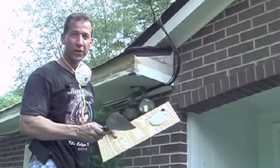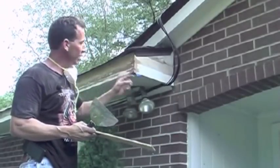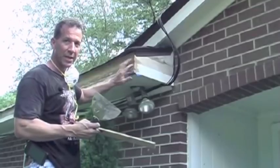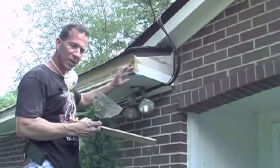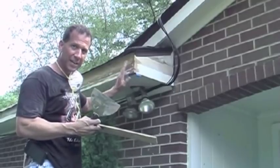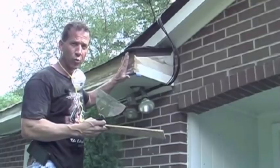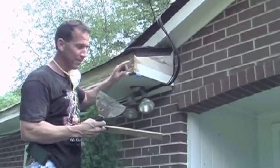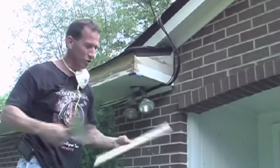The best wood filler is body filler. I use Bondo for these corners. This corner is not rotted — it just swelled up some. You know how those corners will do when water gets in between there. If you fill this up with Bondo and sand it, you'll get a really nice tight corner that looks great, and it's also water tight. Once you prime and paint this, it will last years. I'm going to mix this up, fill this in, and now we're going to have perfect corners.